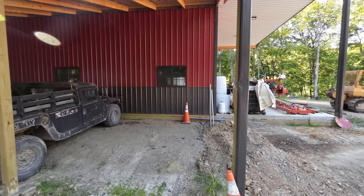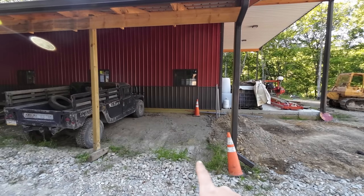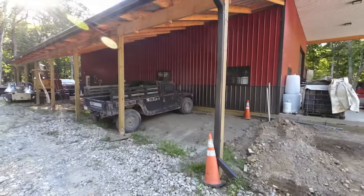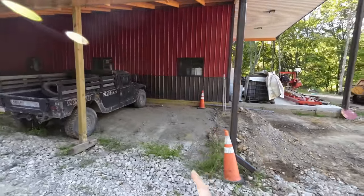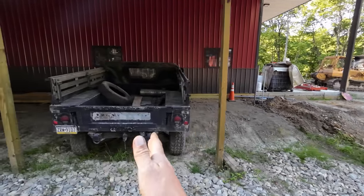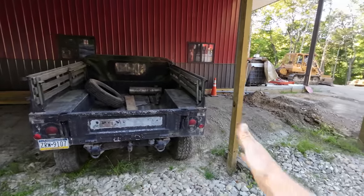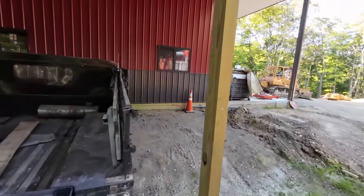So over here under the lean-to on the corner of the building, I want to enclose about a bay and a half and make it kind of like an office slash tool room. I'd like to expand, enclose and insulate about a bay and a half of this. It's 16 feet because the posts on the building are 8 feet on center. So it's like 16 feet of the lean-to here I would like to get enclosed and incorporated into the building,